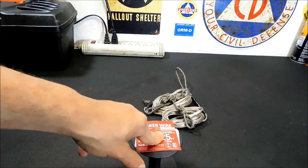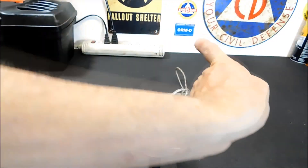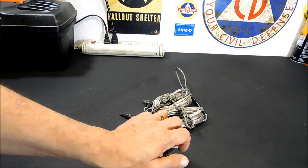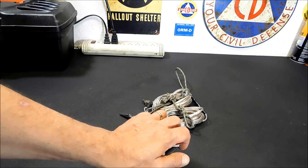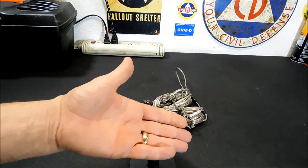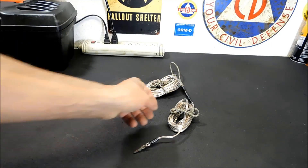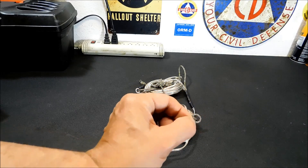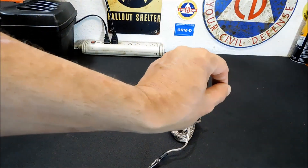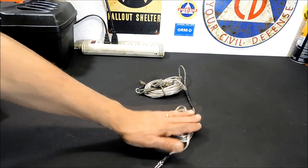I've got 25 feet because I want 10 feet up from my radio, and 15 feet each direction when I split the wire. The reason I want 10 feet up is because I'm 6'1" — in a bug out or emergency situation, I'm not likely to get higher than 10 feet. I also want a little bit of lead to run down to my radio so I can move it around comfortably. So if I'm putting this up between two nearby trees, I want enough lead so I can sit there comfortably without pulling on my antenna all the time. That's why I chose the shorter length.